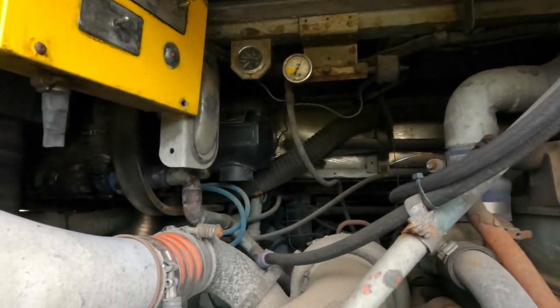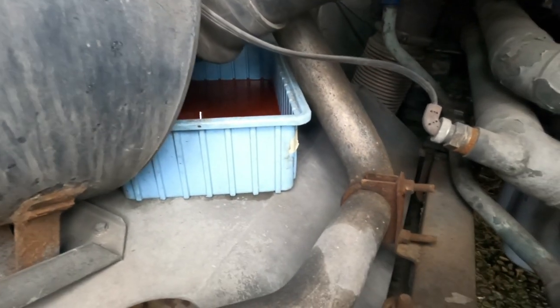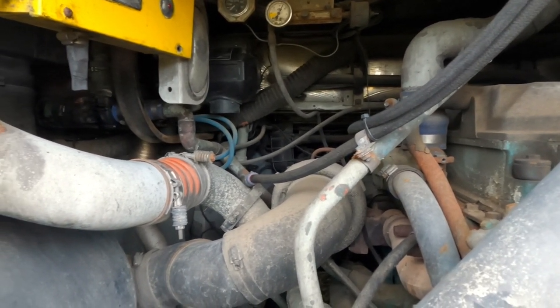This section right here is what I'm not sure about - our radiator is all the way up there. By the way, here's the color of the coolant - a lovely cherry red. I put a tray down so I can catch it. So I'm going to tackle it here in a little bit. I should mention: I'm editing this and realize I didn't explain - that coolant pump is only for when the diesel heater is fired up. When the engine is running, you have flow from the mechanical water pump, so taking this out doesn't affect the operation of the heat when the engine is running.